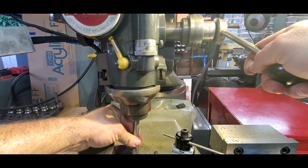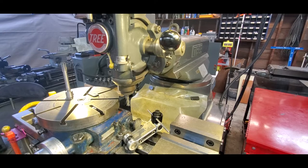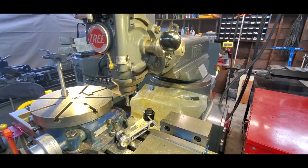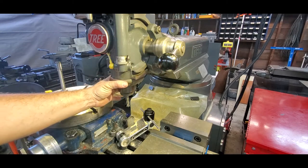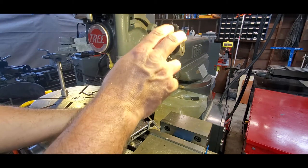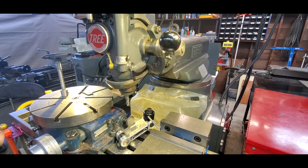When you get good at it — in, out. Some people don't like the Tree milling machines because they can't get used to this collet closer. They'll put pliers on it — they have no idea how to use it. You just got to get the feel for it; it's actually pretty easy. Yoke out — if the yoke won't come out then the handle has to be all the way up. If the handle's down a little bit and stuck there, the yoke won't come out. Make sure the handle's all the way up, yoke comes right out. Pull down on the handle and that opens the collet. Put your tool in, pull up on the handle — that closes the collet. Close the yoke.